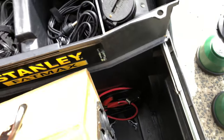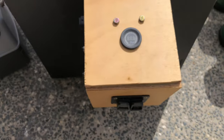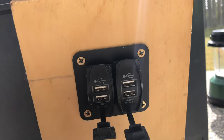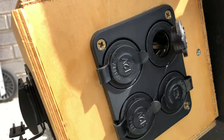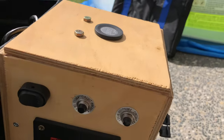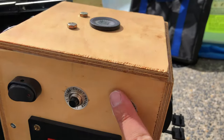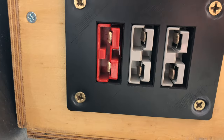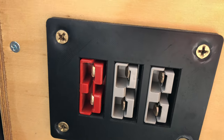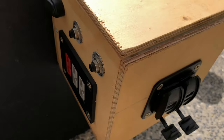And this is my box that I have made. On the front I've got some USB ports. Around the side I've got four cigarette lighter ports. On the top there's a little voltage meter. Then around the other side I've got a master power switch, a 30-amp circuit breaker for the solar circuit, and a 30-amp circuit breaker for the main circuit. I've got three Anderson plug ends: the red one takes solar input, I've got a solar regulator built into the box, and the other two are how I connect up the battery and another appliance if I need to.